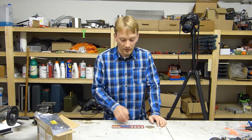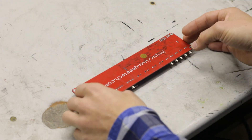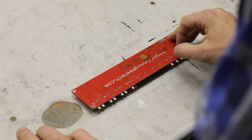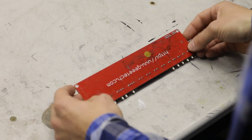The through-hole soldering of the connectors is fairly good as well — there are no dry joints or cold joints — but they managed to smear a bit of solder around this part, which is almost causing a short, but just doesn't.